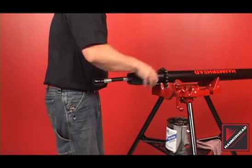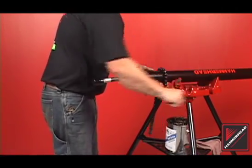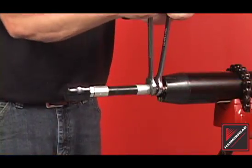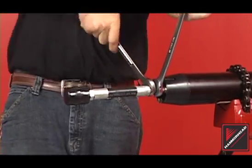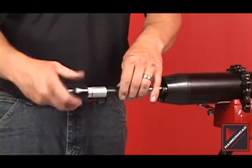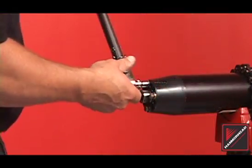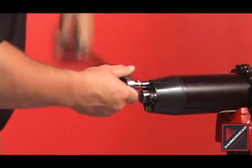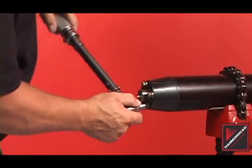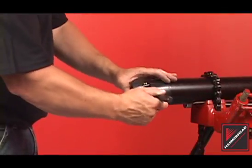Secure the piercing tool using either a pipe stand or a chain wrench. With two wrenches, remove the external whip hose. To remove the rear assembly, start by loosening the tail bolts approximately two rotations each, and unscrew the rear assembly from the body.